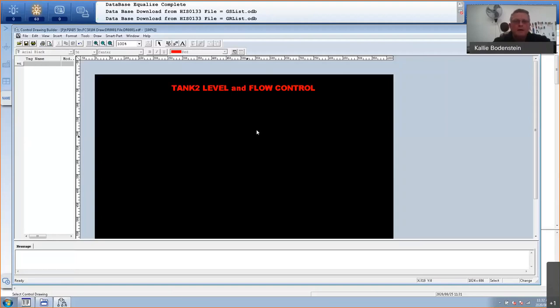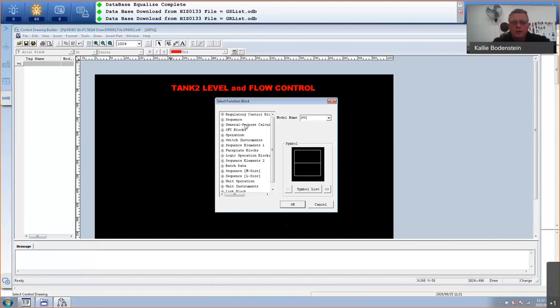Now I'm going to start entering the blocks. Now, obviously, in any DCS, there are predefined blocks like PID blocks, the ratio control, lots and lots of different things, manual loaders, PVI blocks, etc. And that you'll find here. If you go there, you see it says function block. And then again, we've got some categories. And also you can select the name here. If you know part of the name, I know it's a PI something, PID or something, you just type in PI, click there and it will show you all the blocks that start with a P and an I, or got PI in. So there's a PID block, or you can go to your categories, and this is under controllers.